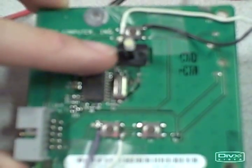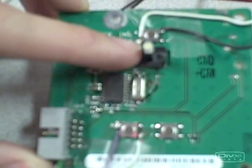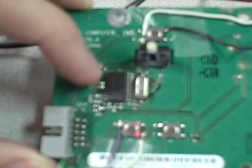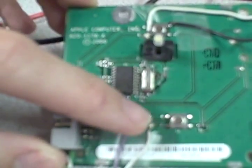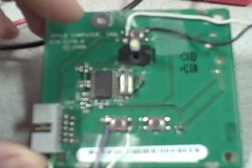By the way, I did take my voltmeter and I went through and tested by putting one lead on here, and tested all around, made sure that none of this was still connected in any way. I tested on each one just to make sure everything was isolated.